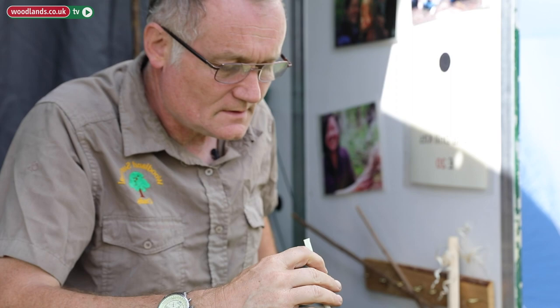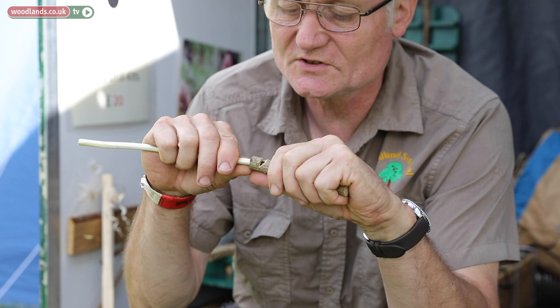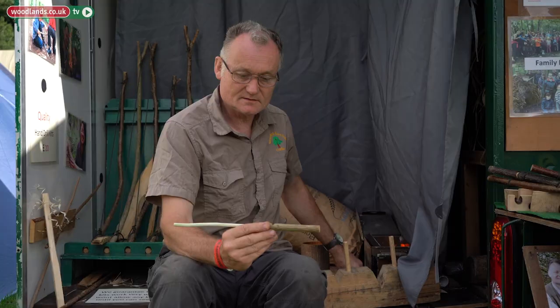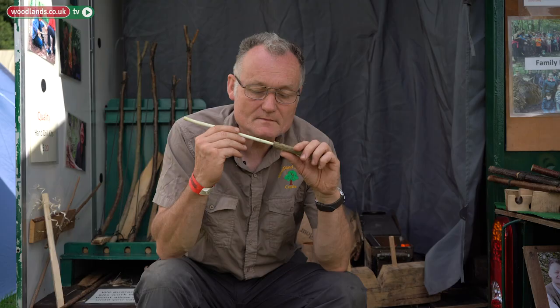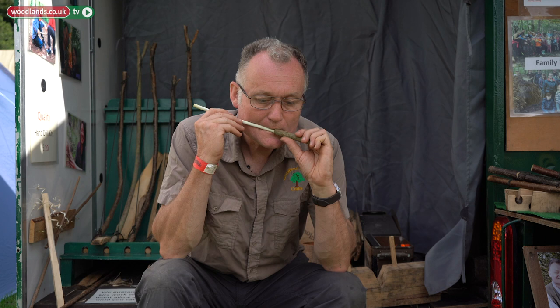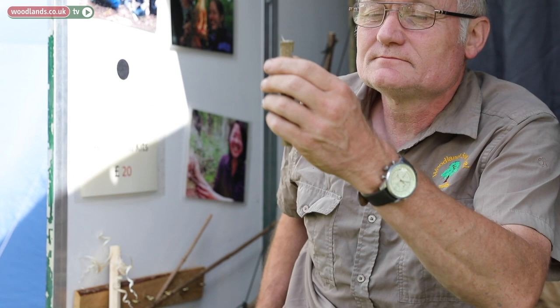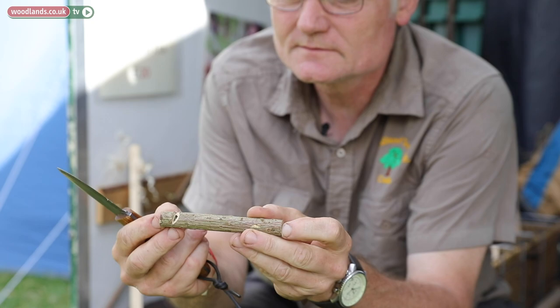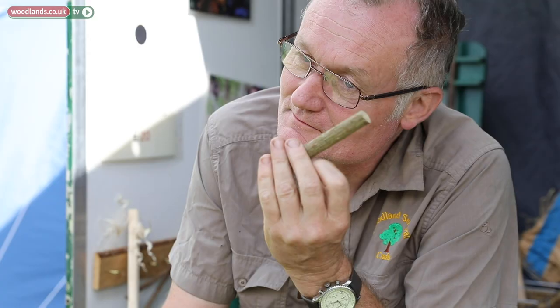With my thumbs acting as brakes I'm going to push this in to where the vertical cut is. I'm going to check that it's parallel to the notch — yes, pretty good. Just checking it works, and now I can saw it off, cut those little bits off, and there you have a whistle. Thanks very much for watching and enjoy having a go at making an elder whistle. Thank you.